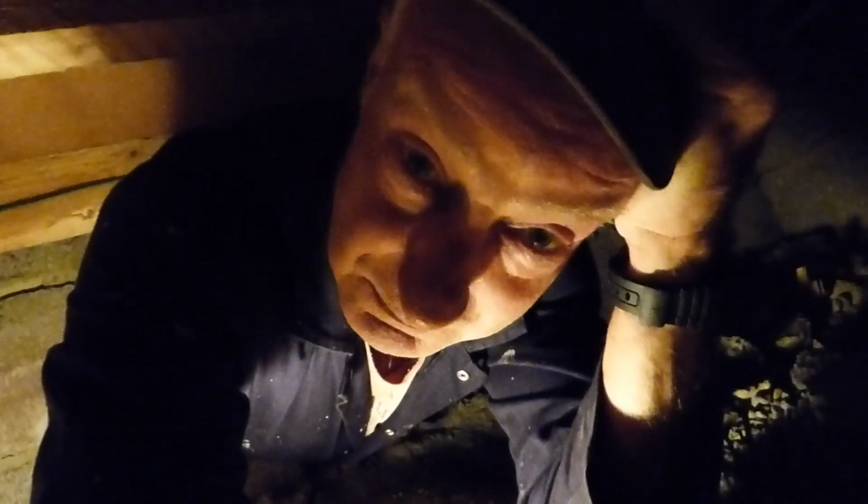So now my stopcock is above this in the kitchen because I'm underneath the kitchen floor at the minute, so therefore I've got to turn the main water off. If yours is the same, it's below the main stopcock, you will have to turn the outside stopcock off. Okay, it's got to be done before you undo anything. So we're going to do that first now.